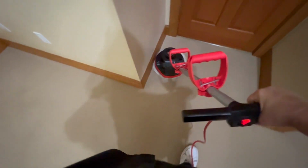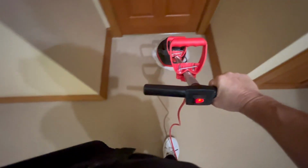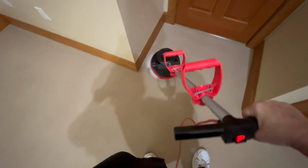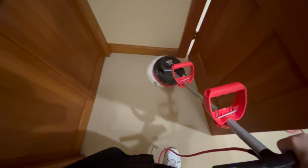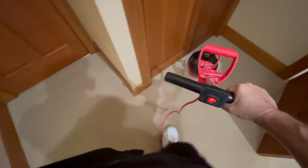That commercial vacuum is important in this process because you don't see any hoses or vacuum hoses on this machine. It's not sucking or extracting through vacuum. So 70% of the soil is dry soil. That's particulate, sand, hair, body skin, spilt spaghetti sauce that dries and crumbles apart. You got to get all of that out with a commercial vacuum. So you're not steam cleaning, you're not using any equipment that has suction. So it's vital that you use a good vacuum, and you vacuum thoroughly along the edges and throughout.